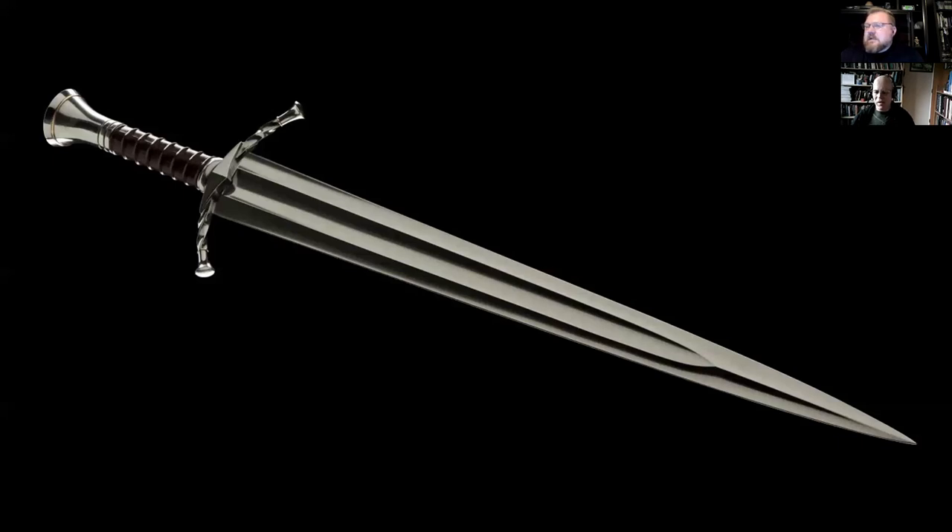All I had to do was, instead of making my initial grinds to an even depth, shallow the fuller a bit towards the tip — so where the fuller might be about a millimeter thick in the thinnest section right up near the hilt, maybe one and a half to two millimeters thick before the runout. That little bit of extra thickness meant I didn't have to take so much off the edges either, because the fuller was already narrowing a bit, and it just made that whole section that had been too flexible a bit stiffer. And then as I was doing the finer grinds, I was refining that flex further. It's really surprising — removing metal at 120, 240, and 400 grit finishing still changes the flex a bit. It's not simply refining the surface; it's still removing metal.